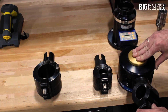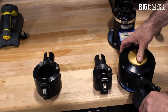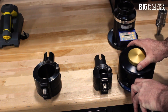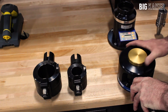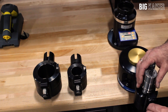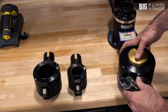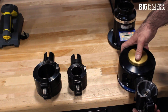The button on the top allows it to move into any of eight different positions for full access to the tool, and there's a built-in locking pin to lock the tool in. Here we'll put in a 30 taper tool holder. It's locked into position with the pin on the side. The pin can be adjusted for both CAT and BT style holders. Then we rotate it around to do maintenance from the retention knob to the cutter.